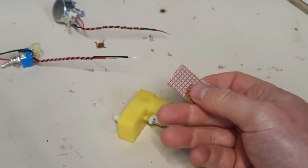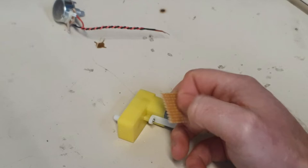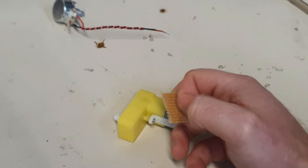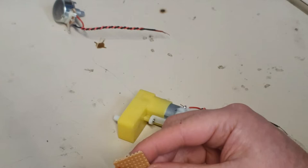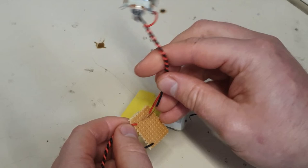Okay, so now it's time for the close-up on how to set everything up on the copper strip board. You want your lines going horizontal — if you have the lines going the other way you're just going to connect everything together, so make sure your copper strip board is horizontal. We put the double pole double throw switch in, with the black down the bottom left and then the red up the top. The next step is to connect the red of our variable resistor to the red of the double pole.